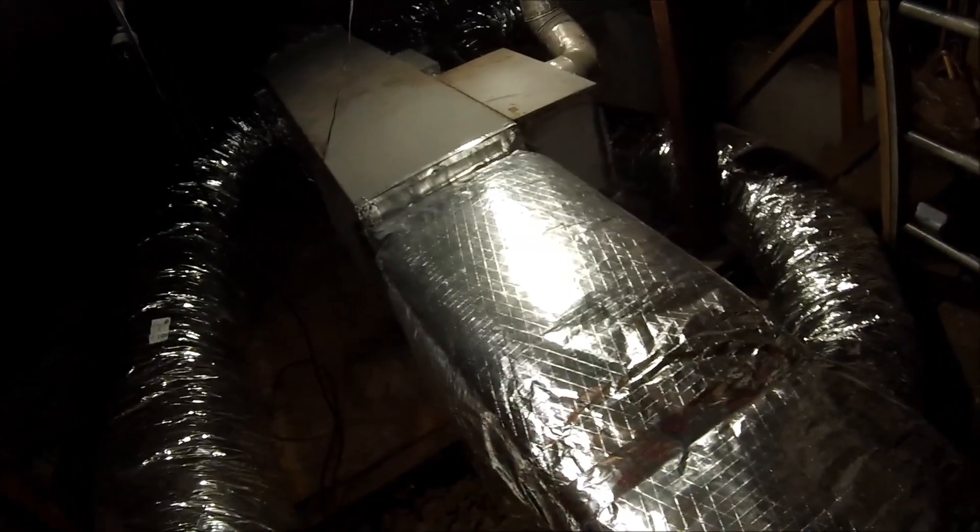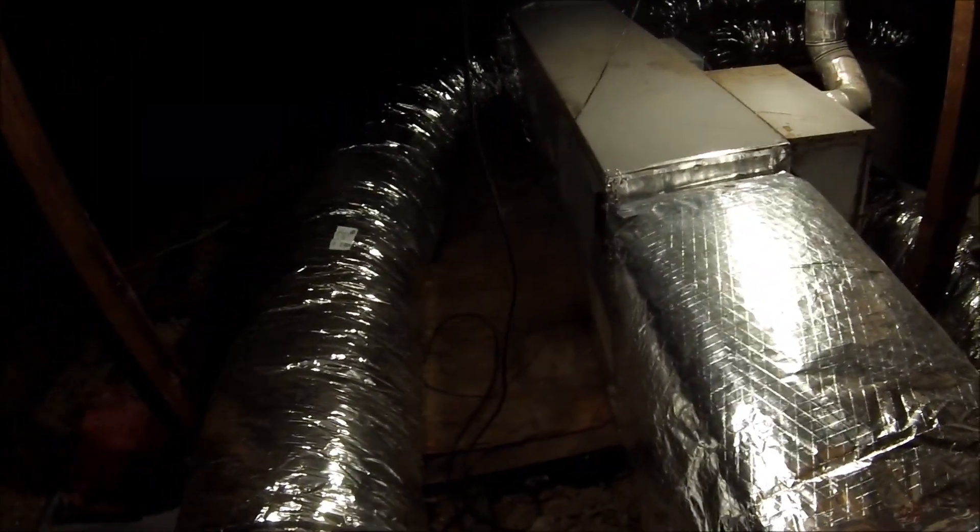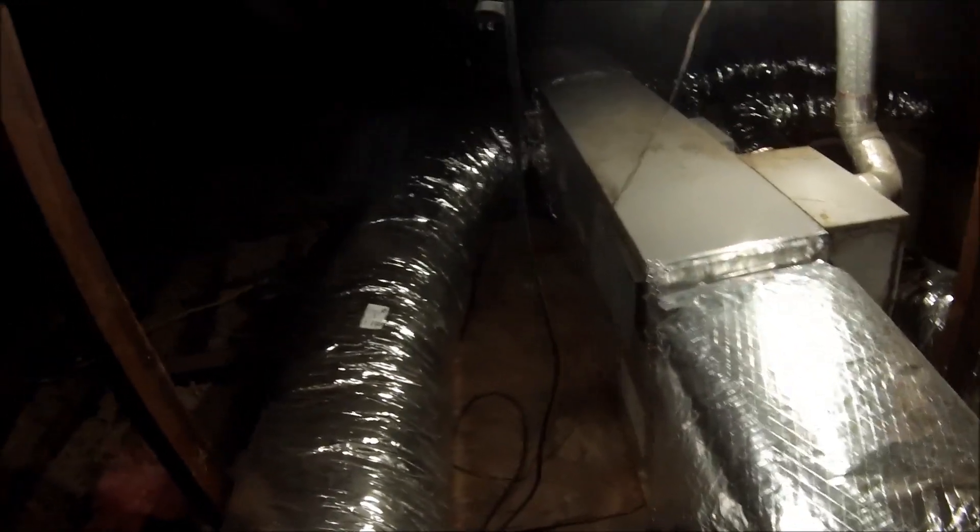My temporary plug is working well — no air leaking out, which is good. That spot is reserved for the master bedroom later. Everything's working great. Next I just have to get new grills — one in every bedroom for a total of four bedroom grills plus one in the hallway — and put filters on every grill. I'll probably remove the filter from this furnace since it doesn't really have a proper filter box anyway. It's a 75,000 BTU furnace — at 80% efficiency that's about 60,000 BTU output, which is plenty for 1,360 square feet upstairs.